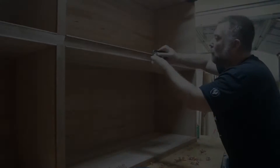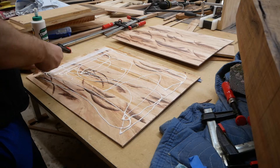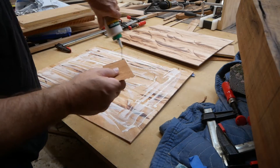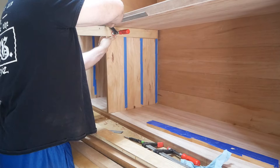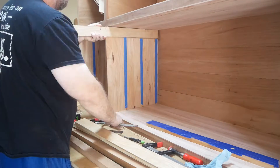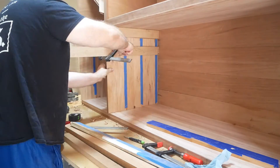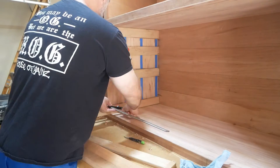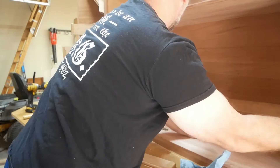In another part of this video you'll see where I'm just using a straight knife to get it down and then sand it flush. I'm applying glue to this veneer and I'm having to do this in stages because of the size of this humidor. I'm basically making some cauls to help apply pressure all the way across, and once I get that on there I'm going to apply some cross braces just to try to push it in a little bit more to make sure I got even pressure all the way across.